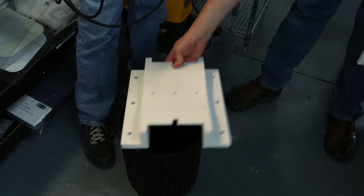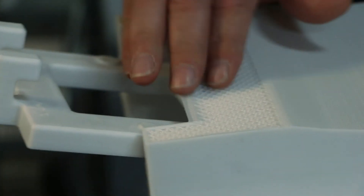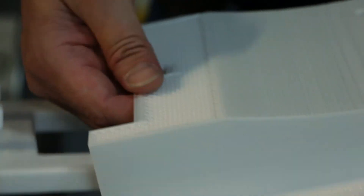Do you see most of your FDM parts are for jigging and fixtures, or do you see some end use parts with this? We do see a lot of end use parts, particularly in polycarbonate and ABS, but it's probably best for tooling and fixturing just because of the low volume nature of it and the durability. As far as the infill on that part, that's about 10 or 15% infill. This program works a little differently — you pick the spacing and a few other things. You're not given a percentage, but it's not very much.